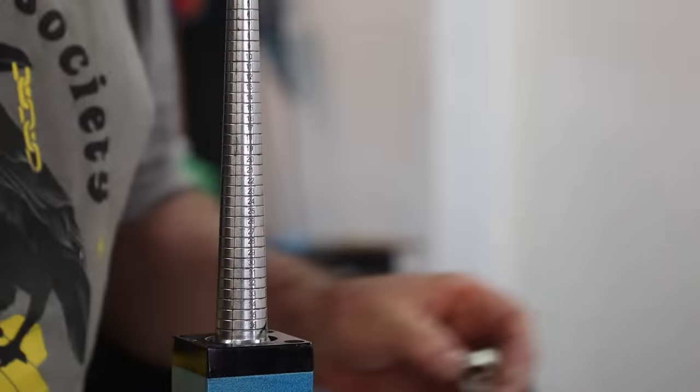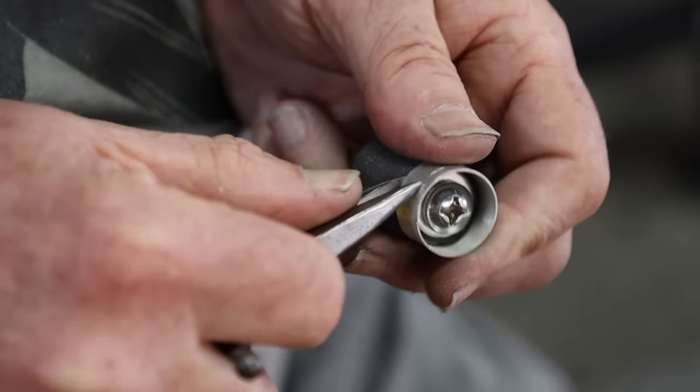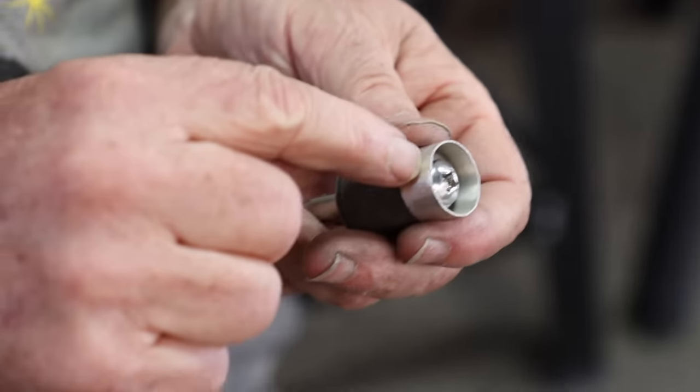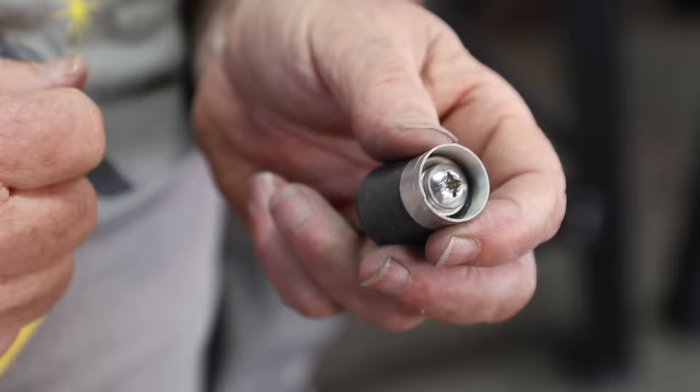Before we continue with polishing and fit, we need to take it down to its final width. So here, Joe is striking the metal at about a quarter of an inch. And then the saw blade will follow the little nick I made if I am very good. So you are very good. We'll see.